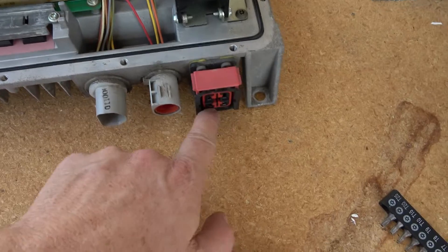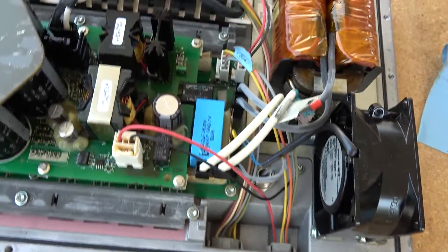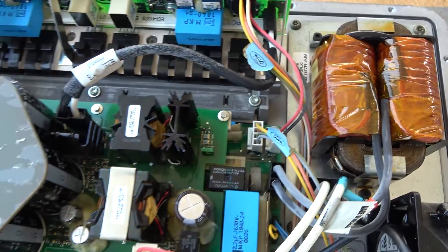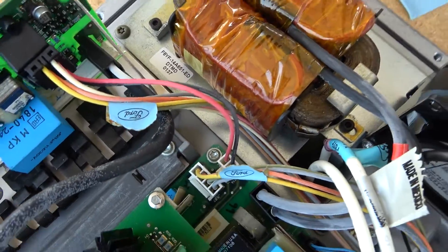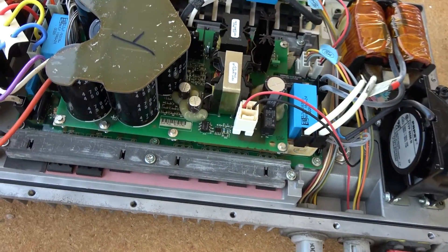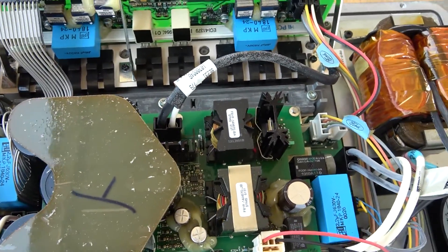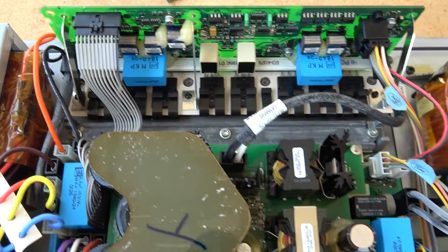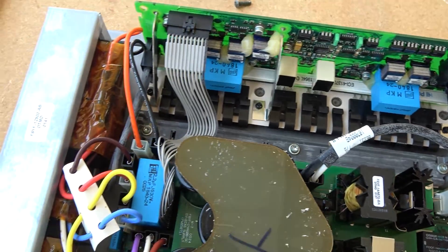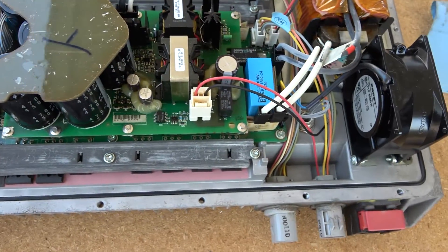This is the AC line in — I'm guessing they're coming out over here with this transformer. I haven't seen a transformer like that since the nineties. And again, look for Ford part numbers. This is the IGBTs. Anyway, this is an inside look into what's going on in an original 20-plus-year-old Ford Ranger Electric level two AC onboard charger — 40 amp, 240 volts.